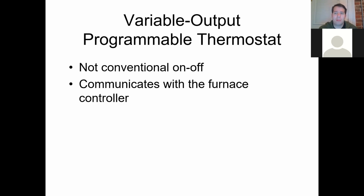They use a variable output programmable thermostat because they can see the effectiveness of it. It's just nice. There are ones where it'll actually track and tell you, for the air conditioning, how many kilowatts per hour it's consuming. For the heating mode, how many kilowatts and how much gas it's consuming. So you can actually know before the gas company gives you an estimate, we think we burned this much gas, this many cubic feet of gas. You look at your last gas bill, and you can already calculate it before the bill comes in. That's the idea and the advantage of it. And plus, if you're checking that on a regular basis, because nowadays that information is no longer just left on those thermostats, because it's microprocessor-based and connected to Wi-Fi, you can bet where it's going to be.